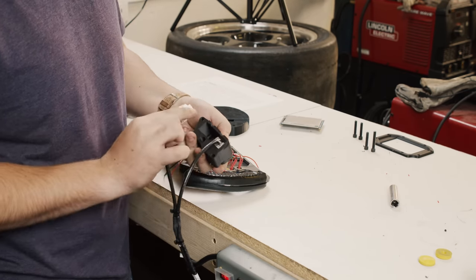I completely changed the base plate yet again. I updated it in the files, but I didn't want to wait for another laser-cut piece so I just milled it out. This is 0.1875 inches — there's plenty of structural rigidity. We have an ABS plate piece on the front and an ABS piece on the back. It's strong enough.